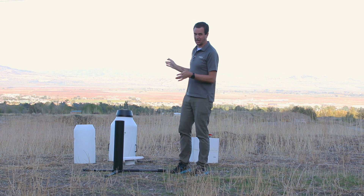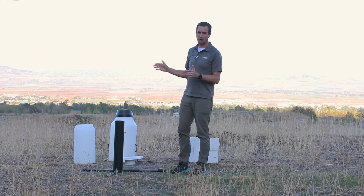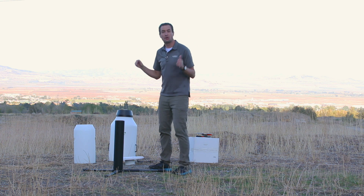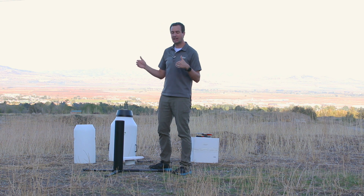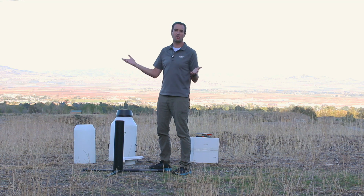This is a great location. Now that you've decided where to put your gauge, you need to put it in the ground. When you're setting your post, make sure that you use concrete so that during the operation of the precipitation gauge it won't shift, move, or go out of level.